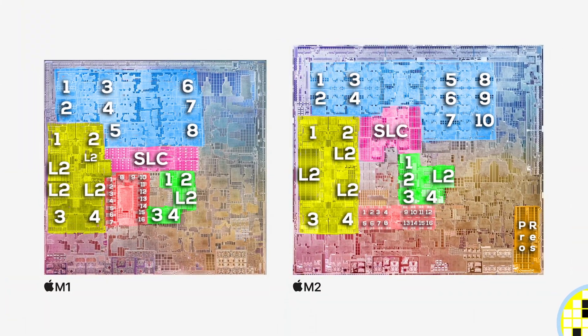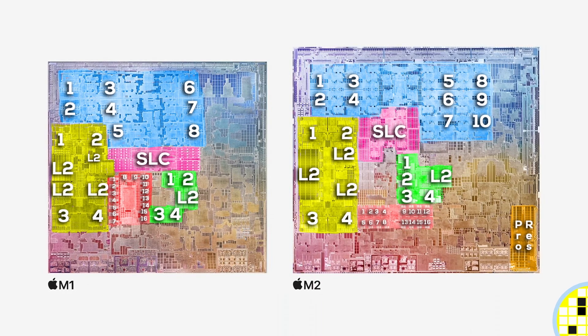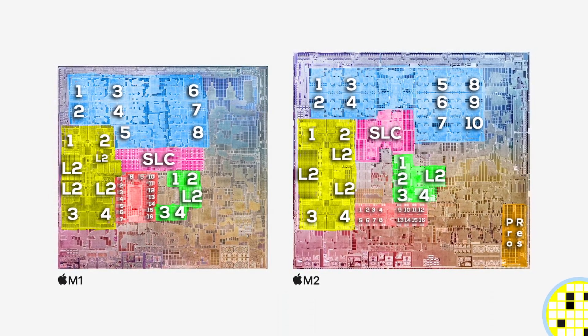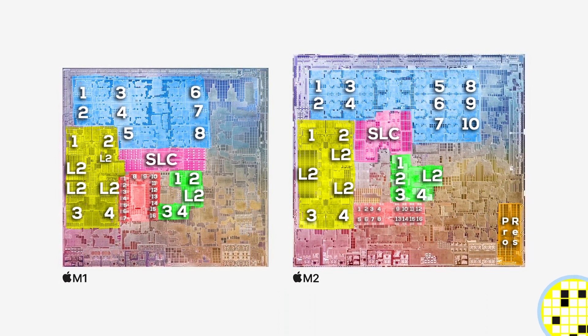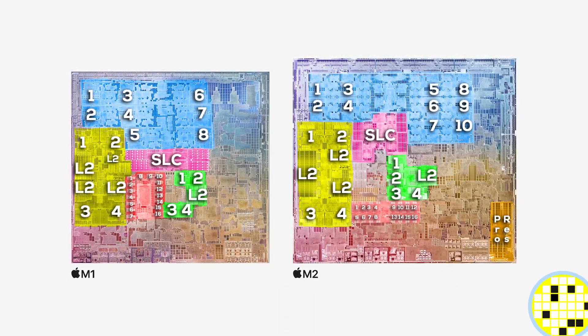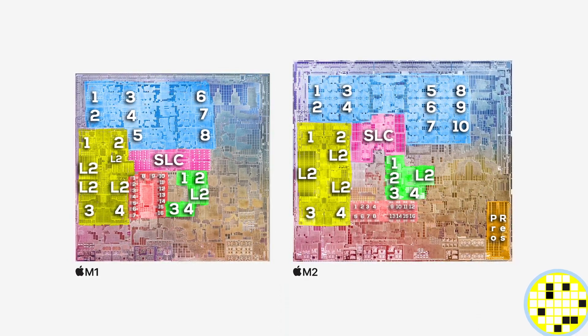I always find it interesting to see how the marketing claims on the slides Apple provides compare to the actual hard facts we can see on the silicon itself. M2 is clearly more an evolution instead of a revolution, but you shouldn't sell it short. Apple took the extra transistors to beef up the new M2 chip, and it's a step up over M1 in every way. The GPU gets two extra cores while hitting the same power consumption, not only resulting in more performance but also increasing efficiency. The CPU performance and efficiency cores are most likely based on the latest A15 design, which means we will see better performance and more efficiency — but nothing earth-shattering. The neural engine actually got a complete redesign, and Apple's impressive performance claims do seem to be founded in the actual silicon. I'm somewhat disappointed that the system-level cache seems to stay with the same 8 megabytes, but I'm sure Apple knows what they're doing. The only mysteries left are where the new ProRes engine is hidden and what exact process node the M2 is manufactured on.